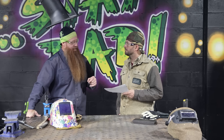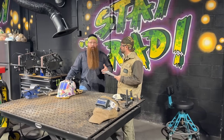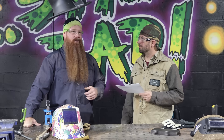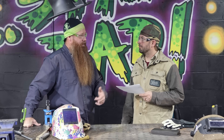After that it gets a little muddy. I always recommend looking at the designation on the side of your wire and matching that up with the manufacturer's recommendation, because there are specific flux cores that are self-shielded and ones that are gas-shielded — you can't switch them back and forth. Certain wires you have to run on DC negative. Most of your self-shield wires require DC negative, but that's going to be based off the manufacturer's recommendation. Some wires are also limited for thickness — some can only be run up to a quarter inch, which puts us back in the same area as short circuit MIG. Select the right wire for the job.